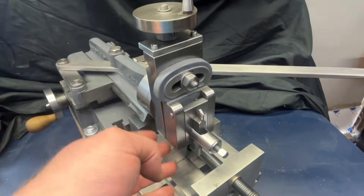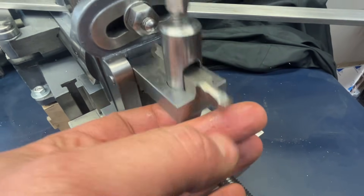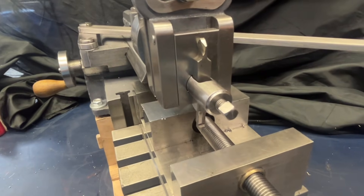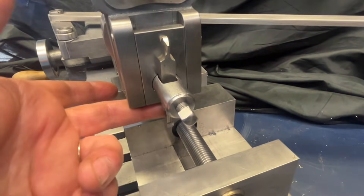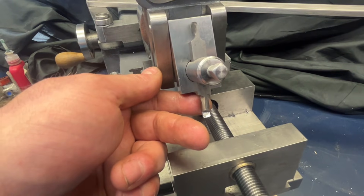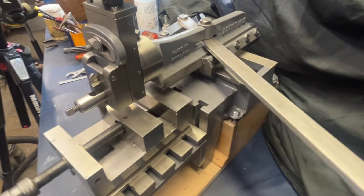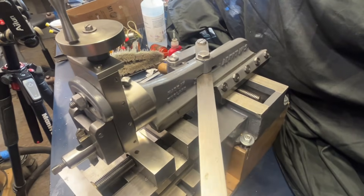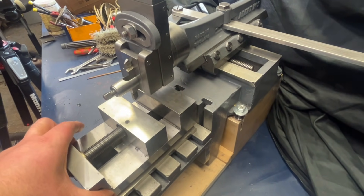It looks like you can change the angle on the head. I've just set up this cutting tool - well, honestly, there was already a cutting tool there and I've just reshaped it and tidied it up a little. For anyone who hasn't used one before - and I'm sure most viewers have more knowledge on this than me - the idea is that you cut on the forward stroke, and then on the backstroke the cutting tool lifts up as you traverse back over the workpiece and drops back down into position again. You can cut some quite long strokes on it.